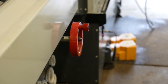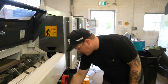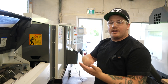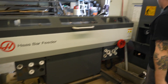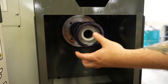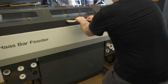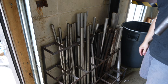There's a big red handle that's very obviously sticking out here. This will adjust our tray. For different types and diameters of material, you switch out the liners, which we have here. These liners go into the back of the lathe up to the chuck and hold the material so it's not bouncing around as the chuck spins. This spring collet comes out, and the liner that holds the material is what we switch out for different diameters. Bar feeder goes back, switch it out, bar feeder comes back in — pretty simple but very effective.